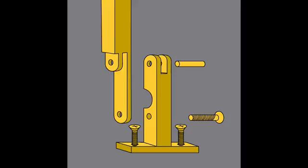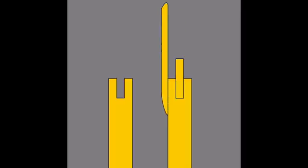I was able to come up with a hinge design that also compensated for the removal of the brass. To create the hinge, I used a milling machine to mill out an 1/8-inch slot on either ends of each of the pieces. I used 1/8-inch flat stock to fill in the channel, which interlocks with the groove in the other side. I also used 1/8-inch flat stock to create a locking arm, and these two get soldered in place. The cavity is created for the eye hooks, and the two pieces are joined together.